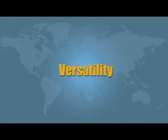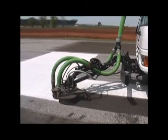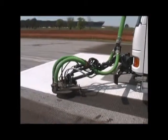Let's talk about versatility, the ability to adjust your speed when rubber is less present. Towards the outside of the rubberized area, rubber marks are often non-existent or very, very thin. When you have a laterally tracking machine, there's no ability to speed up. The forward speed of the vehicle is limited to where the rubber is heaviest across that lateral track. Whereas with a linear, every 40 inches, you're given another opportunity to increase or decrease your speed according to the thickness of the rubber. Wherever there's runway rubber to remove, very often there's some paint to remove with it.